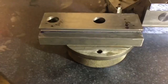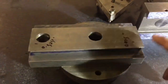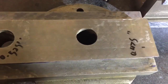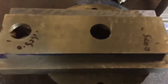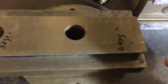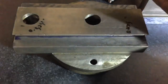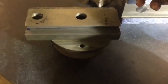One thing I found pretty interesting — I always complain about the surface ground reference surfaces on these machines. On a good machine you'd use that as a reference, but on here you can see where I've stoned it, you can see these little facets — that's tiger striping, which is generally a wheel out of balance issue, just shitty surface grinding. There's also a very distinctive line from here to there.